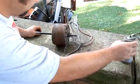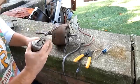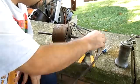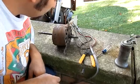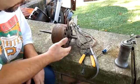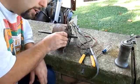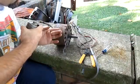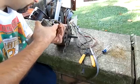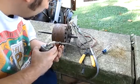The bottom line is these motors are oiled, which is amazing considering most of today's stuff isn't. Go ahead and plug it back in — this is pretty much how you would service one of these motors. It's vibrating because it's a rigidly mounted motor sitting on concrete. There's a little bit of bearing noise, so I'll give it another couple of drops of oil and hopefully it's getting down there to the bearings.